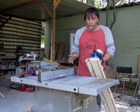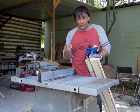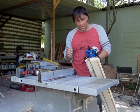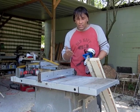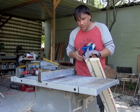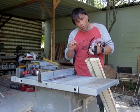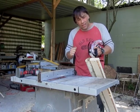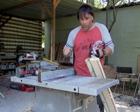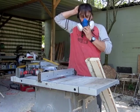We're going to have to do multiple cuts for this because we need to get it wider. The panel is just a little bit more than 5/8 of an inch thick. If you're doing the coroplast, that's usually just one or two fine cuts with the blade, and it slides right in there. You don't want to go too wide because then you're going to have gobs of silicone. You want it to just fit in there snugly, but not be so tight that you have to really jam it. So we're gonna get geared up for this.